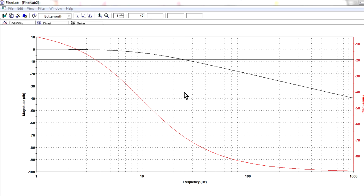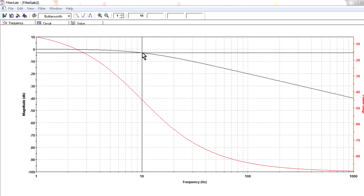But with a filter cutoff of 10 hertz, that means you're not going to be able to change your output voltage really quickly. And on a DC power supply, if you're manually turning a knob, it's not a problem. You can't turn that knob very quickly at all. You're going to turn it only, effectively, 5 or 10 hertz at most, or something like that. You're not going to get huge, big step changes on your power supply because it's filtered out.